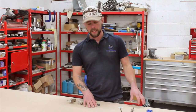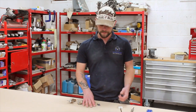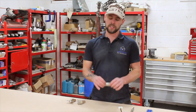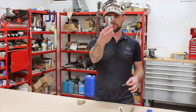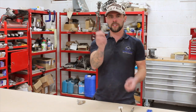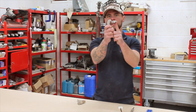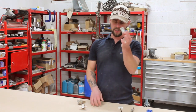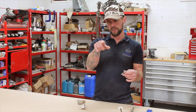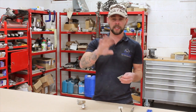When either buying or building your own cabinets, there are a few things to consider — the most important being materials. Hinges, for instance: this is an industry-standard hinge, but this one here is a hydraulic soft-close hinge. The quality difference is clear. With the basic pinion hinge you need a little plastic push button to shut it, which is a bit fragile.